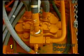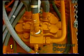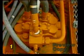Floor-mounted control levers are connected to the hydraulic control valves by reach rods with open-center, spring-return, dead-man controls, or by hydraulic pilot lines or hoses which control a pilot-operated valve. These controls are easier to use and are comparatively safer than the hand-foot brake clutch systems found in earlier mechanical machines.